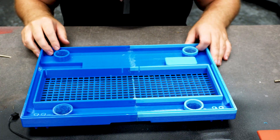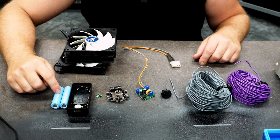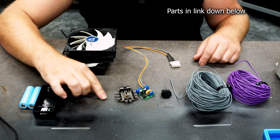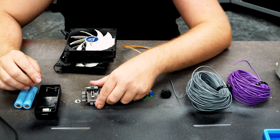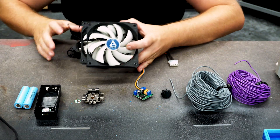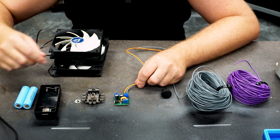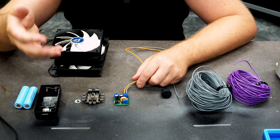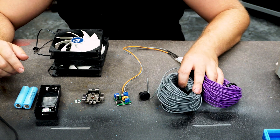Now it's time for some electronics. This is what you're going to need: I'm using two 18650 cells with a cheap power bank like this one. Then we have a BMS. Then we have the fan controller — this is only to split out the power to all the fans. You need three fans. Then we have a boost converter — this takes the lower voltage and ramps it up to the voltage we want, higher in this case. Then we have a switch button and two types of wire.